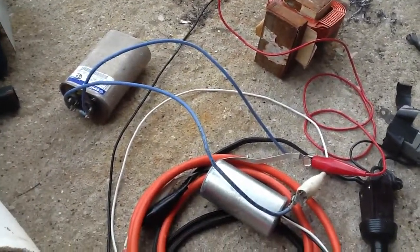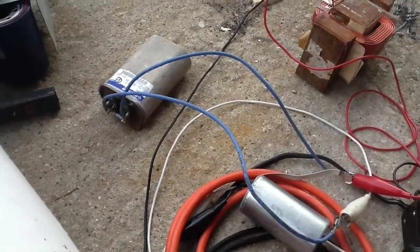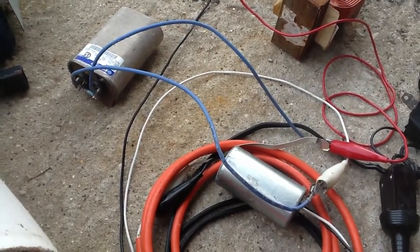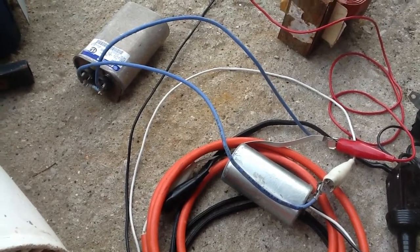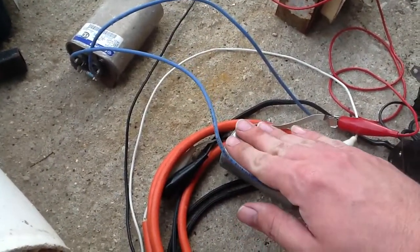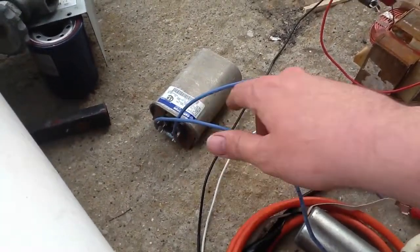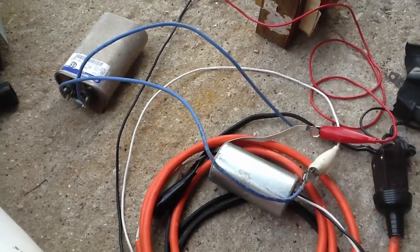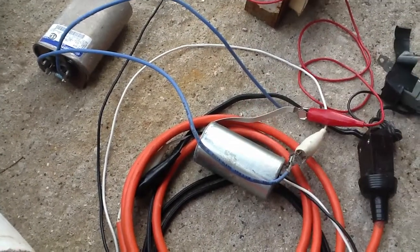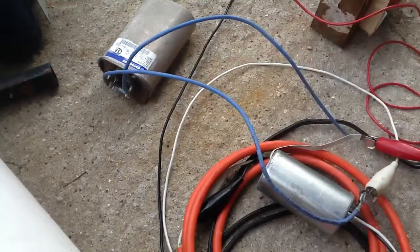The only thing about this that you want to make sure about is your capacitor has to be a motor run capacitor — basically a special AC capacitor with very low ESR. You can run it for hours and it just barely gets warm. They're going to look like this. The reason this one looks different is because I removed it from its casing — what we have here is just the meaty center, what's inside.